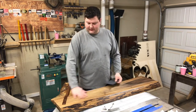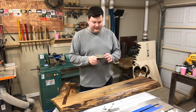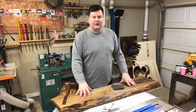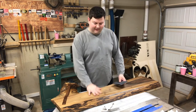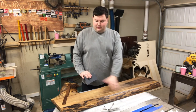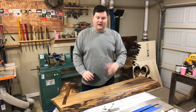It's been about 12 hours and it's dry and ready for another coat. This time I'm going to sand with 1200 grit instead of 320. I used 320 on the first coat because it raises the grain, but from now on I'll sand with the 1200. I'm going to sand everything, put a coat of finish, wait until tomorrow, probably put one more coat, and then we'll install the legs.